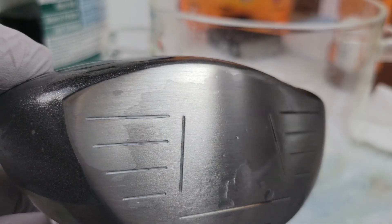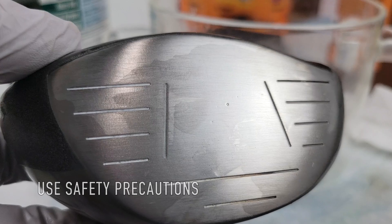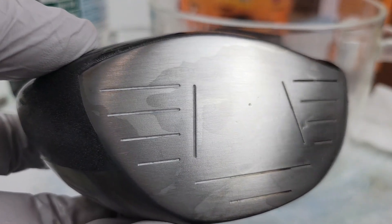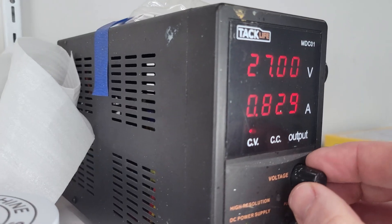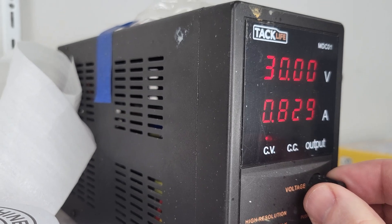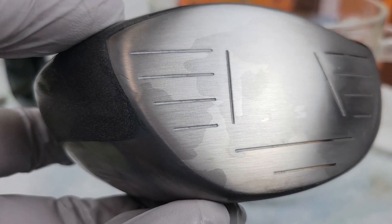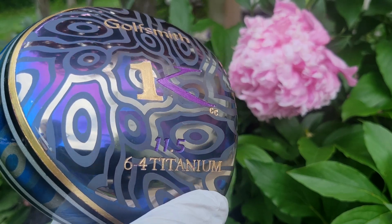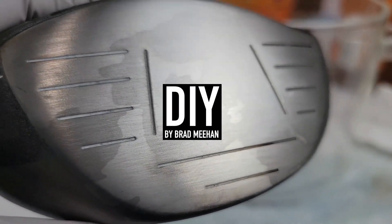So that's it — I showed you how to anodize titanium using batteries. Some words of caution: you are dealing with electrical current, this is a DC power source and we're up to 90 volts, so use safety precautions. Also, the longer you set it in the solution the hotter those batteries can get, and if they get hot they may rupture. You can use a power supply, but mine only goes up to 30 volts so I can only get into a purple range. With batteries you can continue to add more and more. Think of all the possibilities with masking, stencils, fades, and sandblasting. I hope you learned something — if you did, just hit the like button. I appreciate it.